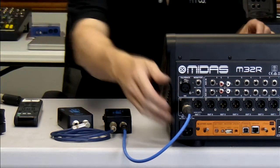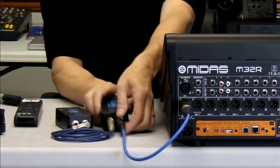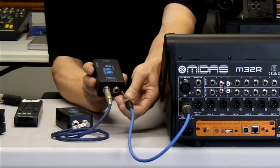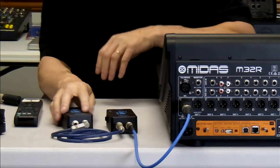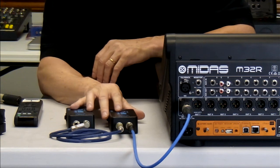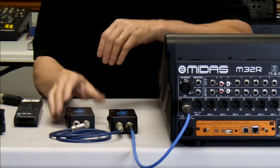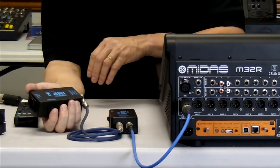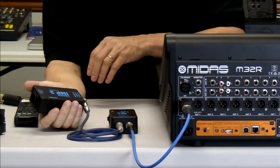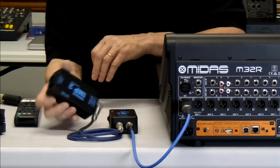I have it plugged in right here, and I'm plugging it into my first Imp2 box, which is a little Whirlwind box. Because this has a high input impedance of about 20K, I can plug as many of these together as I want — realistically, I could plug up to a dozen together and it would not load the circuit down. These feeds then go to each of our video cameras, and I would do a ground lift on each of these to keep the camera's ground from getting back into my PA system ground and causing hum.